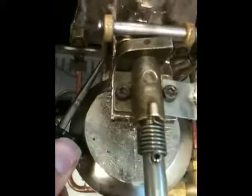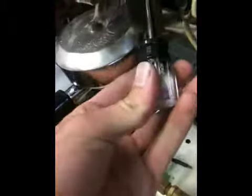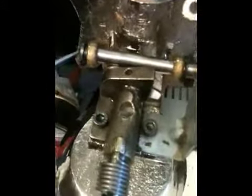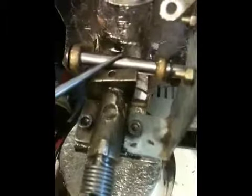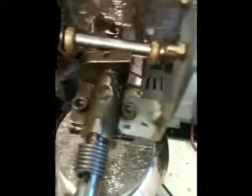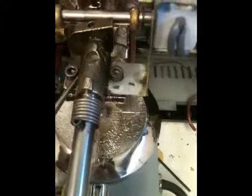There are a lot of lubrication points here that have to be serviced and kept up when the technician comes out to work on these groups — here and here on the forks. This is the exhaust fork for the tube; it's all one piece, and any excess espresso gets purged out of this exhaust tube on both sides. All these lever assemblies have to be lubricated and taken care of, so whenever you have your technicians come out to service this, everything needs to be lubed — any moving components, the sliders as well on the FCS series. It's part of keeping this thing in top operation.